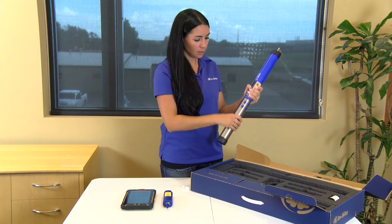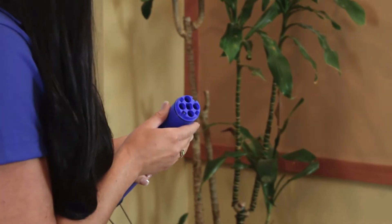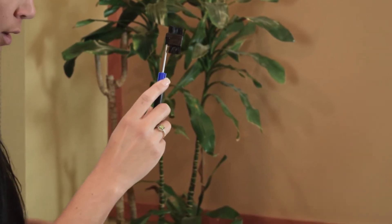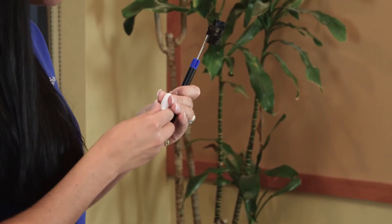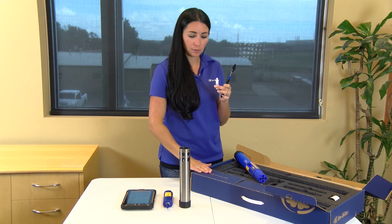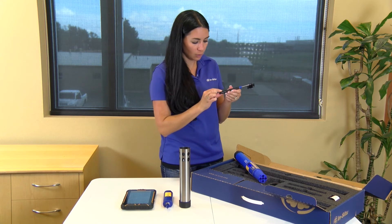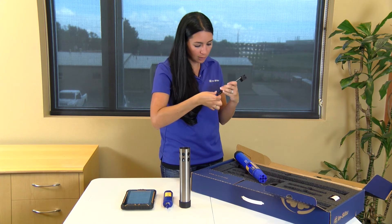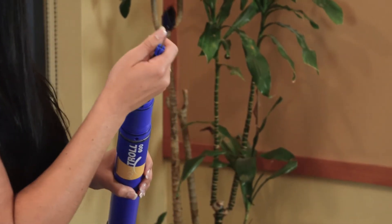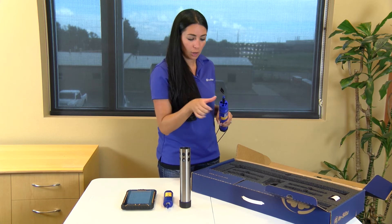Next we will install the sensors. You want to move your restrictor and you'll notice the different sensor ports. It's very important to make sure that you start with your wiper, which is at the very top. You'll see little notches at the top of the wiper. Before installing the wiper, you always want to make sure that you have enough lubricant on your O-rings, so you never want those to dry out. When installing your sensors, take a little bit of lube — about the size of a pea — just a little bit on the surface of your finger. Make sure that the O-rings are free of debris, and put a very thin layer across the base of those two O-rings. Then install into the center port of your instrument. It is keyed here too, so it will help you to orient that.